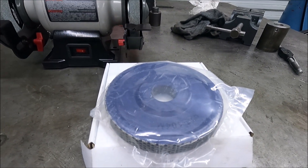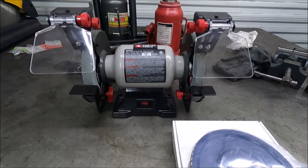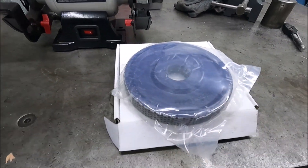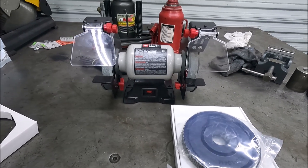If you use a regular grinding wheel, you do it just a couple of times and it leaves a great big groove in the grinding wheel. I'm only going to use this grinder as a tungsten grinder and that's it. What I want to do is put this wheel on it and make some kind of guide, which should be pretty simple.